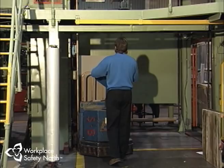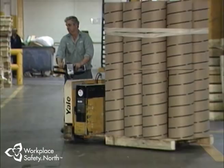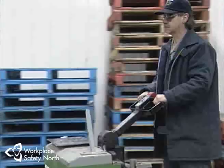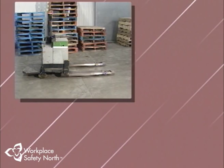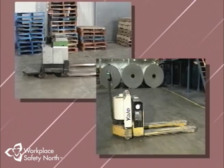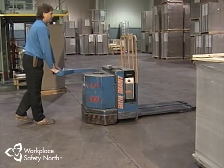There are two basic types of low lift pallet trucks: the ride-on and the walkie. The walkie is controlled by the operator on foot, while the ride-on has a platform for the operator to stand, allowing you to ride the truck as you maneuver through the mill. The walkie unit has abrupt stop brakes, which let the operator stop the vehicle very quickly if necessary, applied when the control arm is either fully raised or fully lowered. The brakes on the ride-on pallet truck are cushion-style brakes, which prevent the operator from being thrown off the platform if braking suddenly.